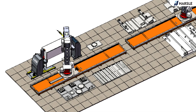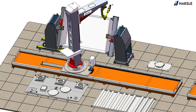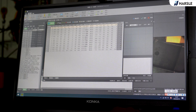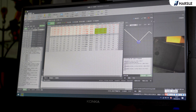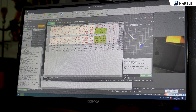The use of the Harsle Fully Automatic Welding Line can ensure high efficiency and stable quality, and can easily achieve batch welding production. This welding line is adopted with the Smart Weld Control System. The system has two modes of intelligent programming: camera photography with manually assisted identification of welding programming, and imported 3D model drawing for intelligent weld seam recognition.